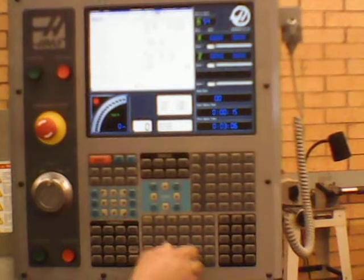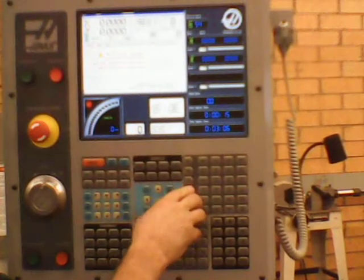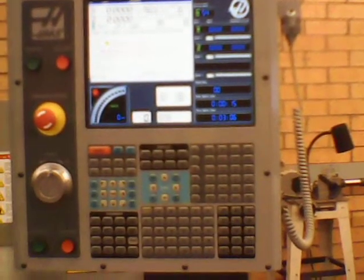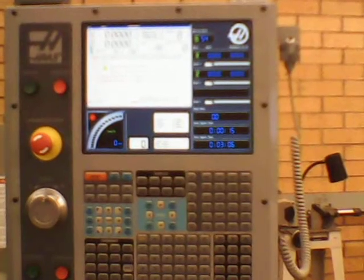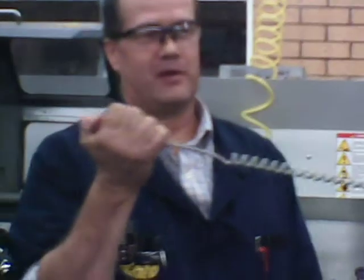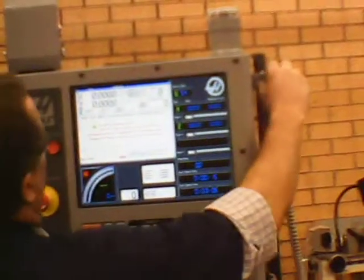And we want to turn the servos on, but I'm going to go to the manual and load first. To do that, you have to push power up restart, but they're all going to give you an alarm that the door is open. That doesn't help. Okay, this one has a switch right here that you could hold down the whole time you were using it, but that gets really awkward, especially if you need hands to measure stuff with. So we're going to disable the door hold override.